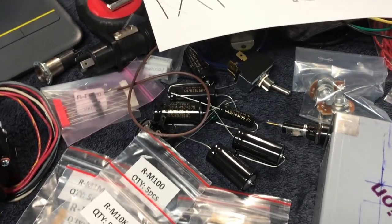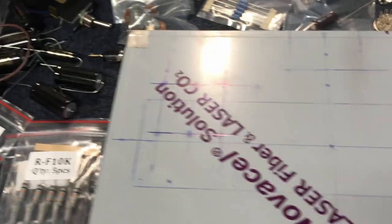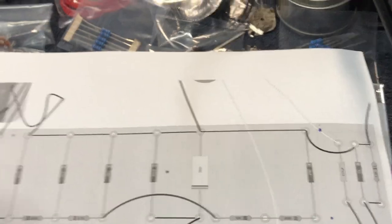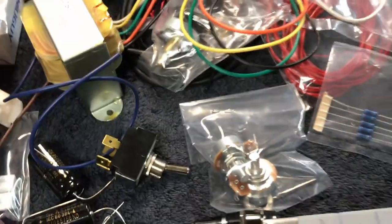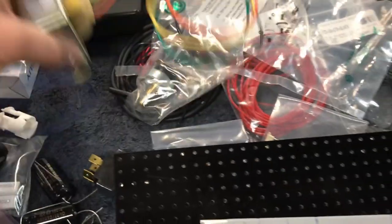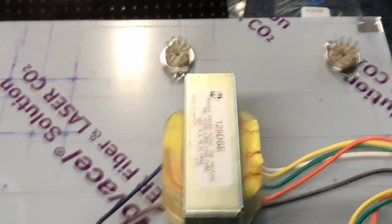The 269EX version you see with a lot of these different amps is exactly the same dimensions as this - it's just a tiny bit bigger in the width. So I'm not as fearful anymore about it fitting. But before I actually drill any holes in this chassis, I need to get this guy built - we need to populate the board. I cleaned up the leads a little on the transformers. There's my Neutrik connectors and everything I need. The tubes will obviously go here, the board goes inside, and I still need to figure out where the transformer goes - I still need to do the headphone trick. This is such a low gain amplifier I'm not too worried about noise anyway.